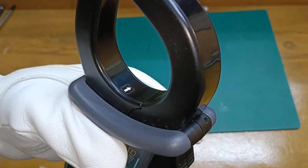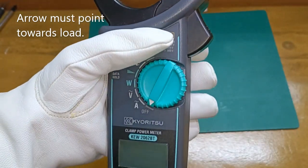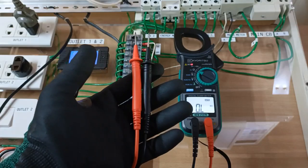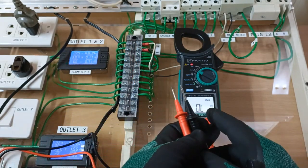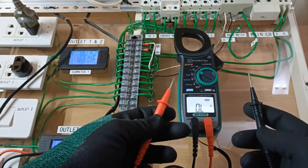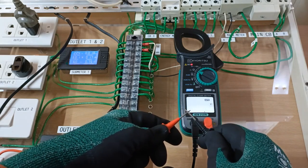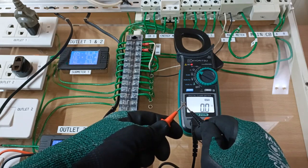That small white arrow is used to properly orient the instrument during power measurement. The front or the face of the instrument must always be facing toward the power source. I'm going to need this kind of test leads for my single-phase two-wire power measurement, but since they did not include this kind of test leads in the 2062BT, I'm going to borrow the ones from my 2127R. The test leads are intact.